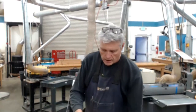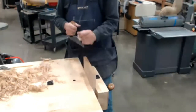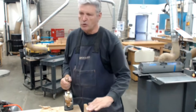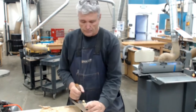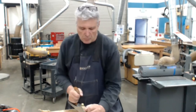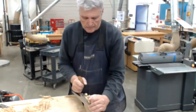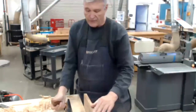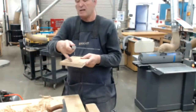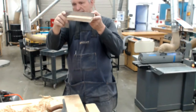We're going to take our board and carefully come across. The trick here is you have to make sure your plane is square — if you go a little to the side, you're going to put a bevel on your board. When I start on the rough side, I'm going to go real slow to keep my plane as square as I can. If I rub my finger across that, it is baby smooth. But the true test is: am I perpendicular here? Thank you Dallas — I need to check if I'm perpendicular.